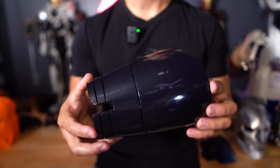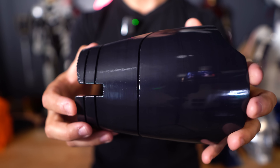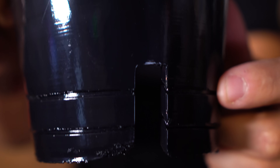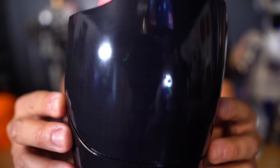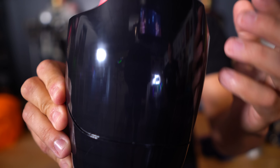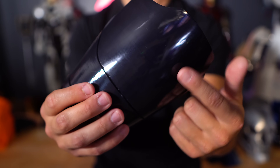Another method you can add to this process is sanding. There's still going to be cleanup that needs to be done. This is a good example of sanding a part before you vapor smooth it. The bottom section here was completely left untouched — a raw print — and you can see the ripples with the light. It feels smooth but you can still feel those bumps. However, up top you can see that the surface is almost perfectly clear and crisp. Yes, you can still see some lines and transitions, but that's more of the color changes and the layer lines. This is perfectly smooth — done with a rough pass of 220 grit sandpaper and then a pass of wet sanding at 600 and 1,500.